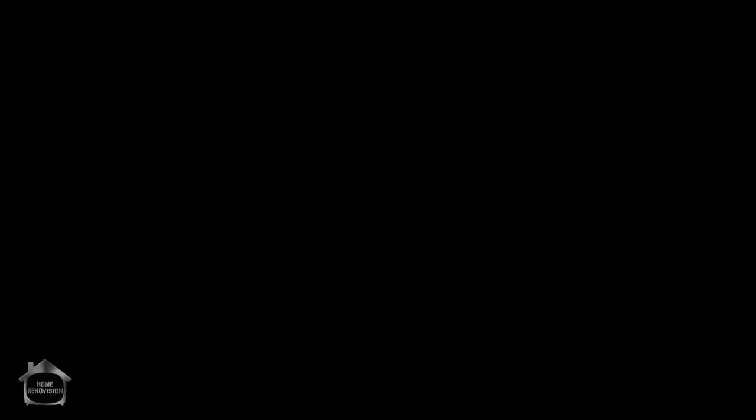The next thing we're talking about is the order in which to paint, because if you do it in the right order it'll save you from getting drips, streaks, and damage. My order is top-down because paint falls. When you're painting and using a brush you're throwing your bristle — if you leave all your crown molding till the end and you're cutting in, you can get paint splatter on your wall. If that's semi-gloss paint with 100% acrylic and you drop everything and run over there with a wet cloth and wipe it, it's gonna leave a mark. Now you've got to paint that whole wall, cut and roll again — a lot of extra work. Always work top-down. Ceiling paint is usually dead flat without acrylic so you can touch that up if you hit it with the walls later.